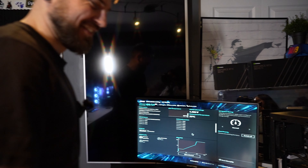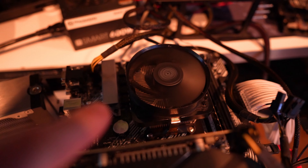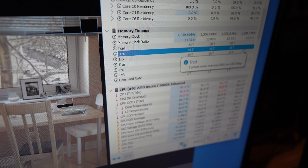We're running Cinebench R23, doing the 30-minute test for stability — multi-core. I've already done a few runs at 10 minutes, but I'm going to leave it on. The other thing is I want the temperature to actually stay high — I want to see 90°C — that's why we're using this very crappy cooler. The point of this is to make sure those pins stay on the CPU. I had to use leaded solder, which in this country we typically use no-clean or lead-free solder. But I think it'll hold up, and running at high temps is better than running at low temps.